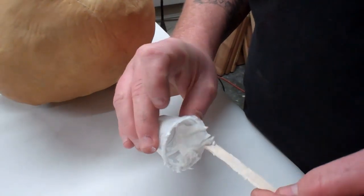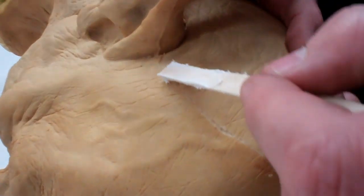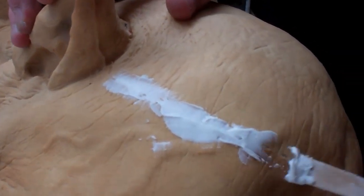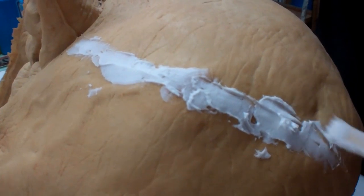Right, so we're going to take a little bit, and you don't have too much time but enough, and you spatulate it in there, and you push it into the seam. Start to get your excess and bring it on down. And you can work in large portions. It doesn't have to be small portions. Try and get the whole area done at one time. So right now this does look a little sloppy, but that's where the water comes in. Right now we're just trying to fill in the gap.